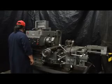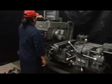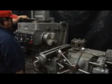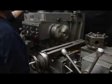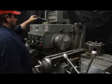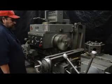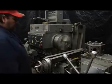The condition on this machine coming from long-time standby storage is absolutely amazing. Additionally, I'd like to point out that it has threading with the quick change box. There are 16 spindle speeds on this machine, ranging from 45 to 2,262 RPM.